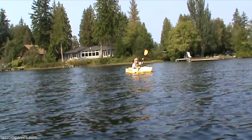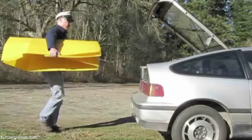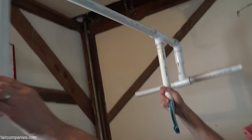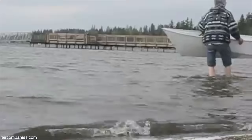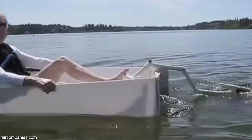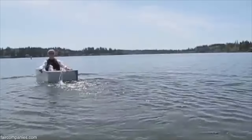Making something, you get a lot more satisfaction out of the item once it's done — that's the joy I have in doing what I do. I started playing around with this little fin propulsion system. It goes on the transom end, pivots like this, and you use your feet to generate the fin. This is an idea I had years ago — I wanted something lightweight, something that wouldn't pollute, something I could go fishing with. Controlled and hands-free. This is taken from a boat called the Thistle, except I used PVC to make it a DIY project. $15 for the hardware, the PVC, and the nuts and bolts — a couple hours of time assembling it.